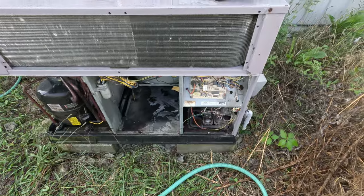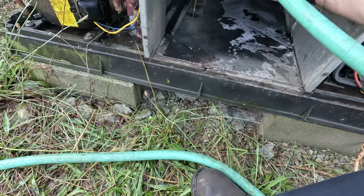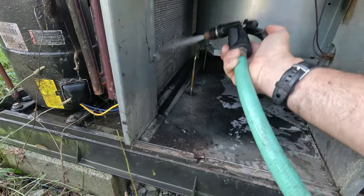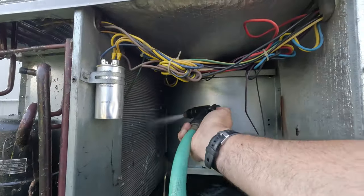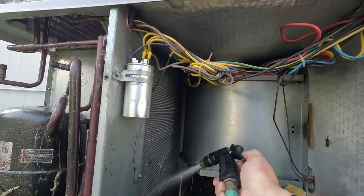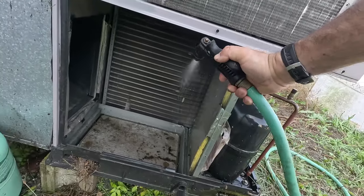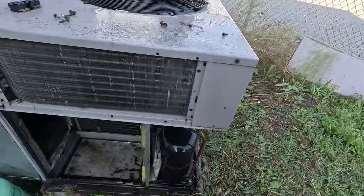Okay, we got that done. No water got into the board, which is good — that backwashed out through here. Make sure there's no crap caught in the middle of the coil. We'll look at the other side and see if a bunch of black material came out. If it did, we know we need to pull that blower and get in there really thoroughly. I do not see anything on this side of the coil, so I'd say we're probably good there.